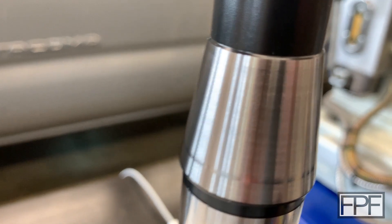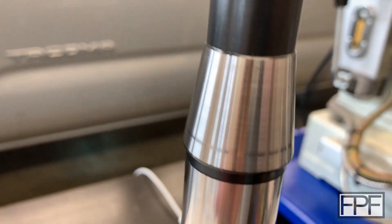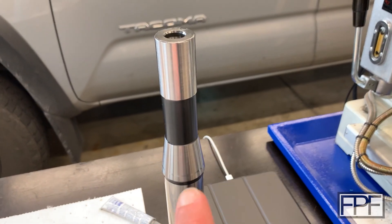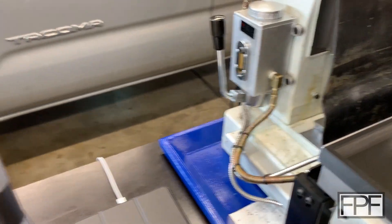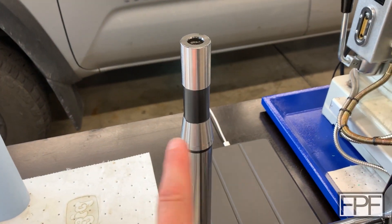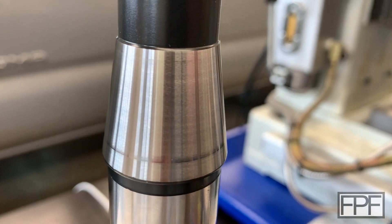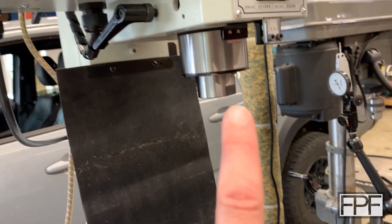We went from completely unacceptable to wow. Let me reseat this. I pulled this out — I don't know if you guys can see this, but the ring down here on this bar was caused by the old spindle; that was the only place it was contacting. You can actually see the contact patch — there's the top of the patch, it's shiny above that all the way down. That's just slight wear on the metal surface, not bluing. When I blued this one, the entire thing was contacting. I put some Prussian blue on the inside of the spindle taper, a very light coat, seated this and the entire bar had blued. I wiped the surface carefully with a rag and then my finger, did the same on the spindle, and reseated it.